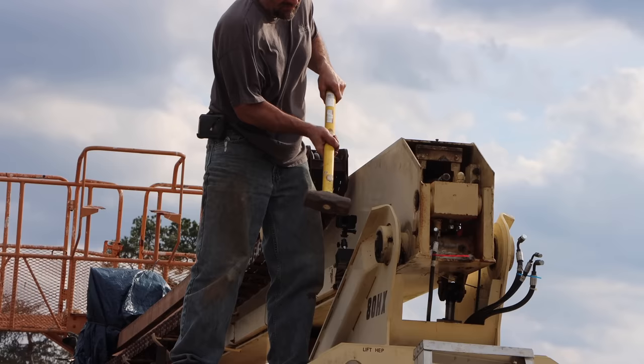You might have noticed when I was setting it up, I kept having to move the magnet over because the quill handles were hitting on this support right here. So when I was actually drilling, the magnet was not fully engaged on the steel, and that makes a big difference in its holding power. So apparently I'm not doing any more mag drilling on this thing, and I'm not hand drilling it. So Sawzall it is.